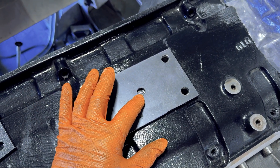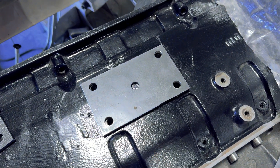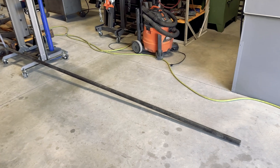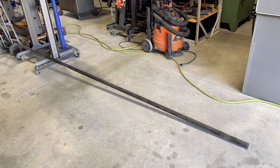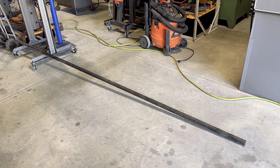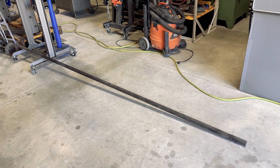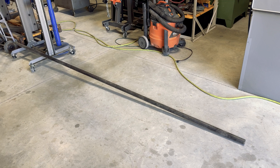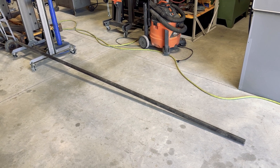I put a hole in the center as well because when we come to weld the pipe on, you don't want to end up with a sealed chamber. We're going to cut the pipe into four sections — a little bit bigger than we need so we can square them up and put the angles on. For a Cummins 12 valve, the engine is about 32 inches long, so that's what length we'll cut our skids. For the down sections, we're going to give it about 16 inches.